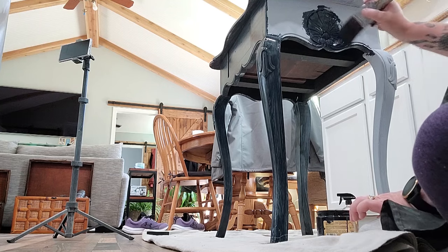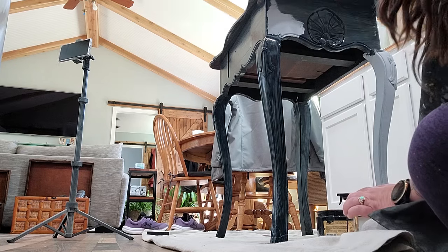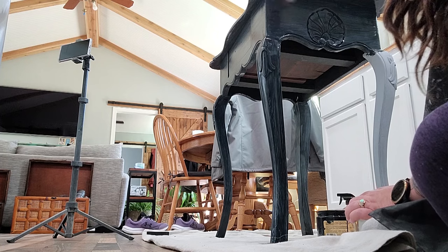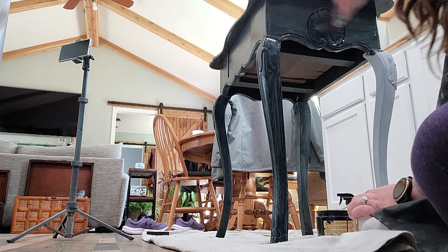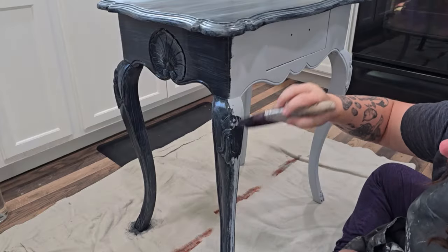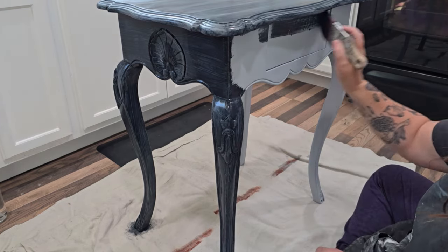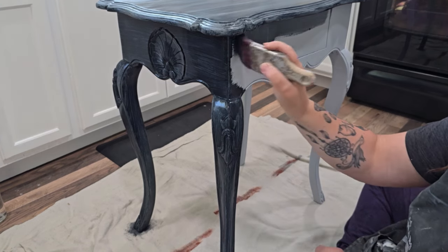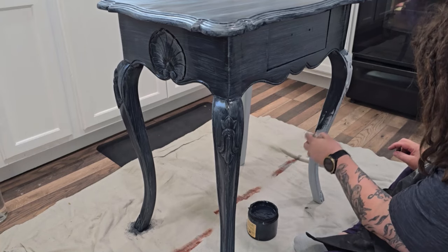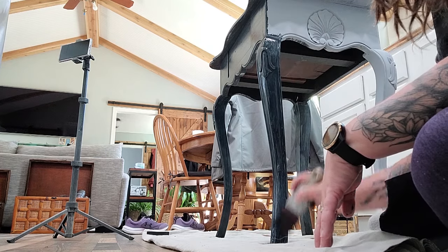This was the leftover paint I had thinned out to spray — the same paint from those black and gold chandelier nightstands. To get full coverage, it ended up taking three coats of this black paint. Normally Dixie Belle paint is really thick and gives full coverage in one to two coats — this is just because I mixed it with something else and thinned it to spray through my spray gun. Since it has enamel mixed in, I do three coats and allow it to dry two hours between each coat, then let all coats dry overnight before moving on.